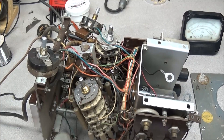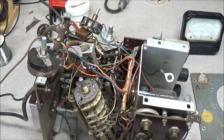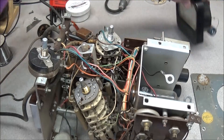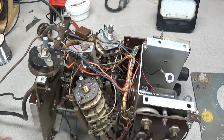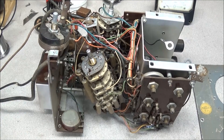There's a lot of work ahead. I've got to do a complete cleaning, test all resistors and tubes, and replace all the electrolytic and paper capacitors. There are also a lot of the big square mica capacitors, like the ones on the back of the meter — I very seldom see those go bad but it's good to check them now instead of having to deal with them later if one has failed. Again, if someone knows what that board on the back is, please leave it in the comments — it is not on the schematic or in the bill of materials.